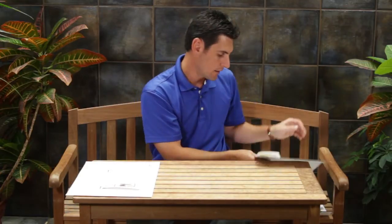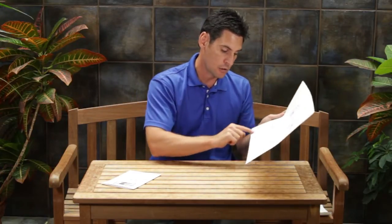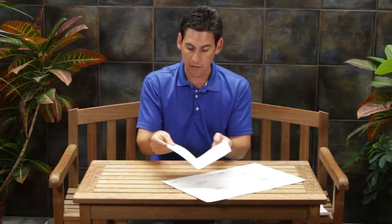Let's look at the last piece now. This is our 8.5x11 v-fold mailer. Just like the other piece, it contains two up on the sheet of paper. Exact same situation — load this in your digital printer, image both sides of the sheet. With this piece, however, you will bust this in half ahead of time, because it contains glues for final sealing. After you cut the sheets in half, take the sheets to your folding room, fold the sheets in half, fold on the score marks that are pre-provided, and the glues will be properly aligned. Then you can take them back to your trimmer, apply pressure to the seal edge of the sheet — don't cut through the sheet — just apply pressure through a simulated cut under your clamp, and the piece is ready for mailing.